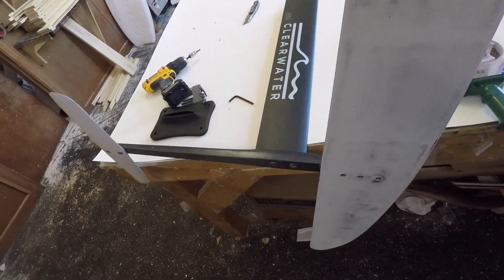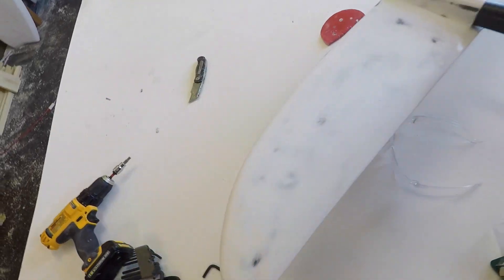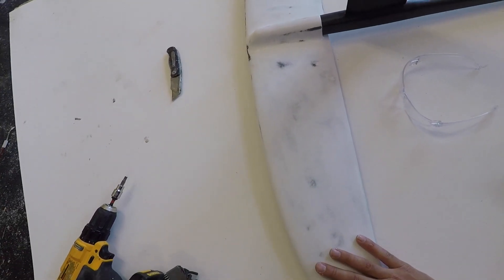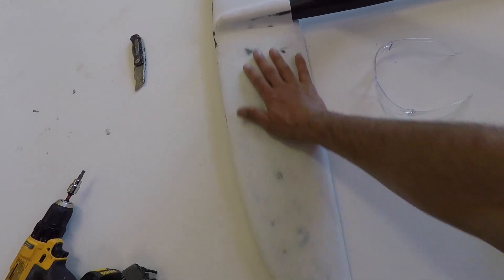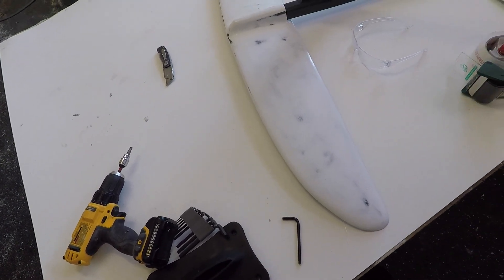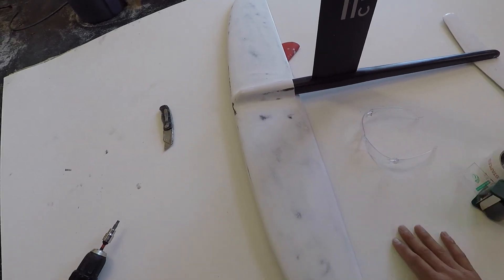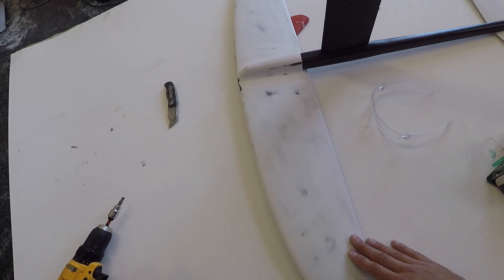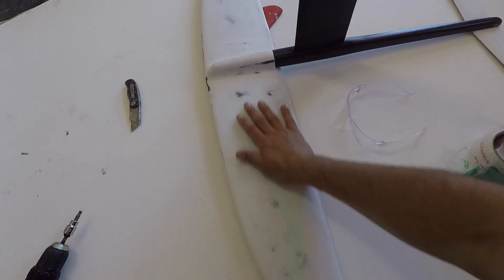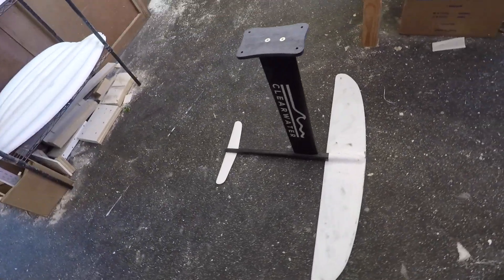Putting the whole foil together now. I gave it a coat of white paint, then went over with some fine-grit paper and sanded it smooth. If there are any defects in the paint job you sand those out and end up with a really nice smooth finish — it also hides scratches and dents that'll occur in the future. I think the reason it's become a popular trend is it's easy on manufacturers: you don't have to stress over a perfect finish, it looks good and it's functional.